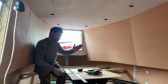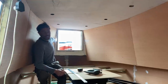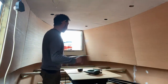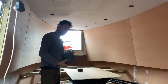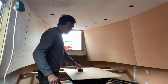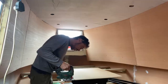So if I was to cut this square, or if the angle of the blade was to go in square, it's not going to sit in snugly. So what I wanted to try to do is miter the angle of the cut, which on some jigsaws you can adjust. On this one, I think actually you can, but I can't really be bothered. I think it should be easy enough — I'm just going to cut it at an angle and tilt it in a bit.